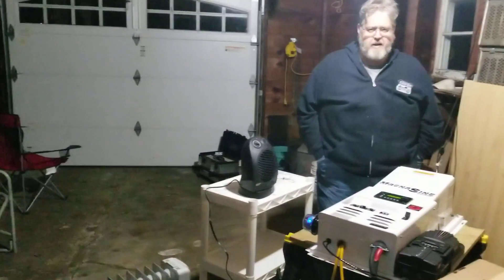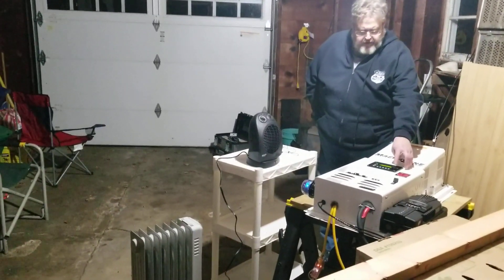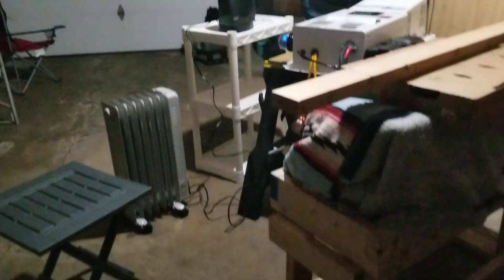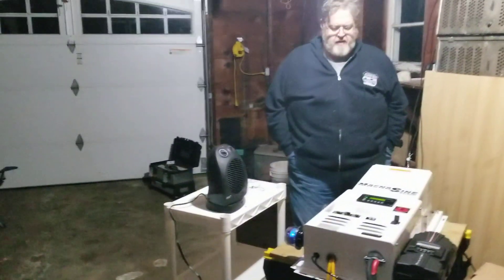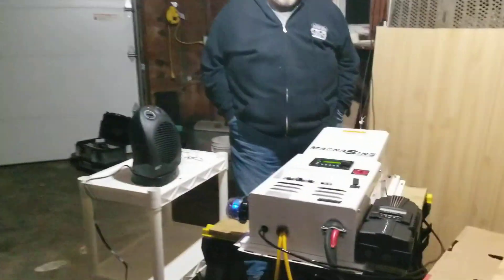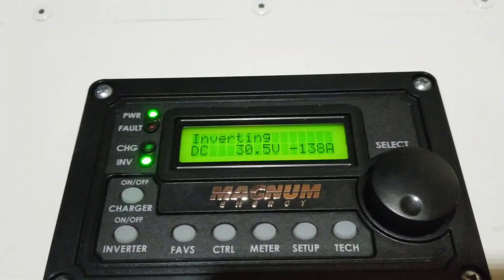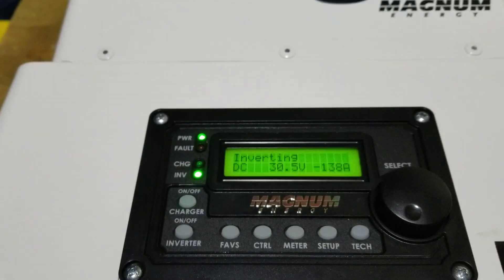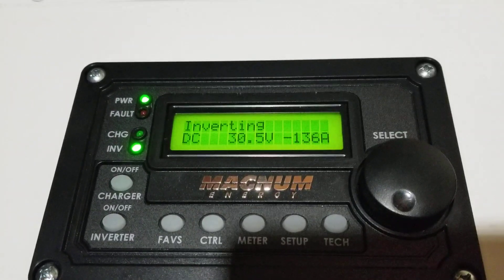I'm a little worried about the system because we're still waiting for an electrician to show up. Dave was a bit scared because the batteries are sitting here — he can't put them down in the basement, so he covered them up, and the solar is just doing a little trickle charge. Right now, looking at 136 to 138 amps at 30.5 volts — if you do the calculation, we are pulling approximately over 4,000 watts. This inverter is 4,124 watts, and look what we're pulling right here — it's a lot of amps.